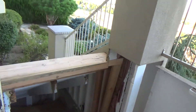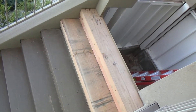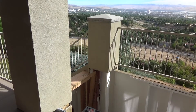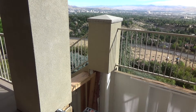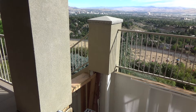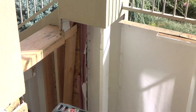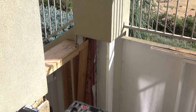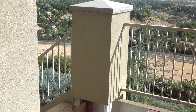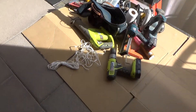I knew it was going to be kind of tough to swivel it in there, but I got her. I'm sure glad those stairs are done. Now to tackle this column — the dreaded column. There's nothing inside it, it's just stucco on the outside. I had to take all the OSB plywood out, all the two-by-sixes, except that one. Fortunately that one two-by-six right there was still in pretty good shape, and the back wall of OSB plywood was okay. Other than that, there's nothing inside, so I have to rebuild the entire thing.